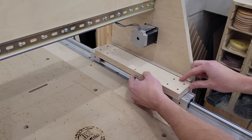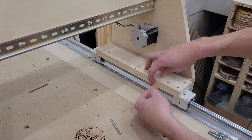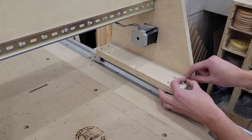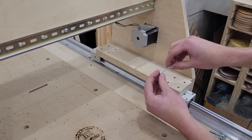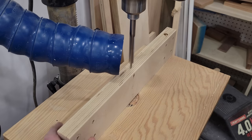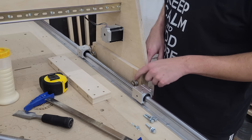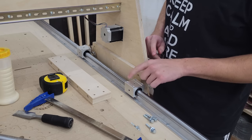So we've got our holes drilled. Now we need to attach this to the gantry and the way I'm going to do that is by using these long pocket screws. I'm going to be using my pocket hole jig drill bit, but not on an angle — through the side like this to about this point so the screw can get all the way down in there and really engage in the upright pieces. Because I'm using that pocket hole jig screw it has that step, so it'll carve a nice flat shoulder, and then we'll come back and drill the through hole all the way through. Now the old V-groove bearings right here are in my way because the bolt pushes out this way — they're going to end up being captive before we can get these into place.